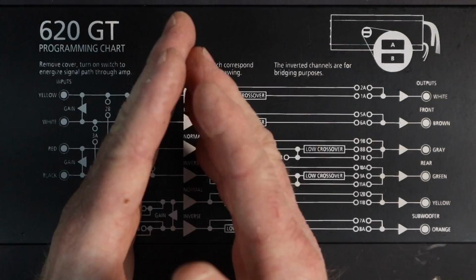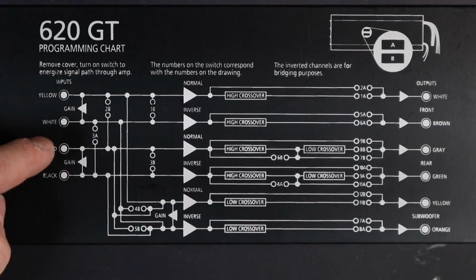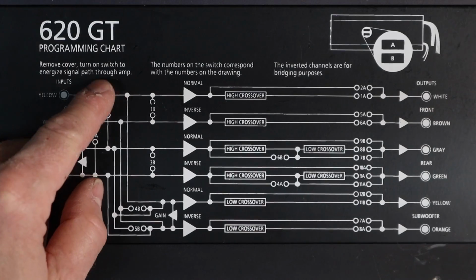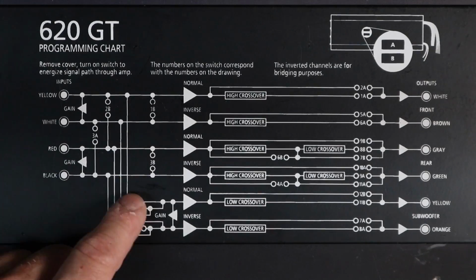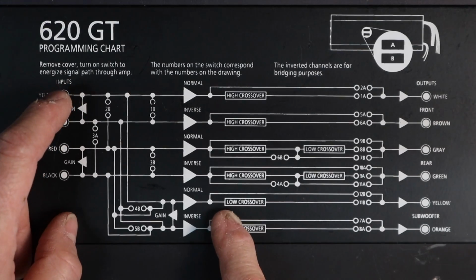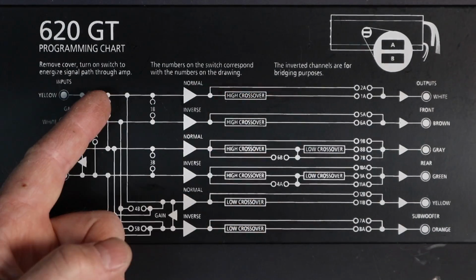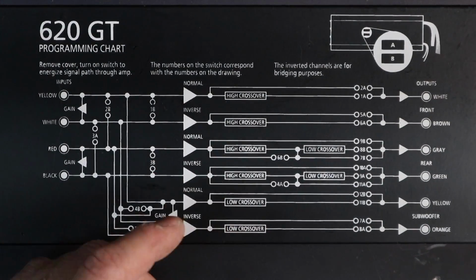So that means we have a non-fading subwoofer. If we fade to front, we fade to rear, this is still going to get signal, but the signal is always going to be after these 2 gains. So if we turn this gain down, we turn this gain up, if we fade from front to rear, this is going to fluctuate. If we have it just connected default up to this, if we turn this down because we need to turn down the volume of the tweeters, then this gain is going to be lower too, because this gain can only be as high as the input allows. That was the big problem in this, because naturally you put it on the tweeter channel, and the tweeter is something you typically turn down, so you turn this gain down, and then voila, here you go, your subwoofer channel is not loud enough. Problem right there.